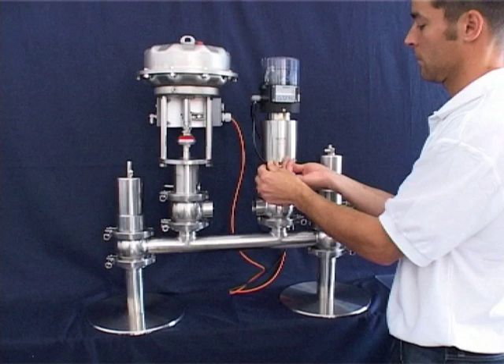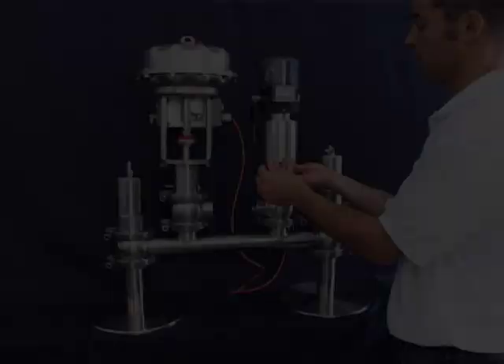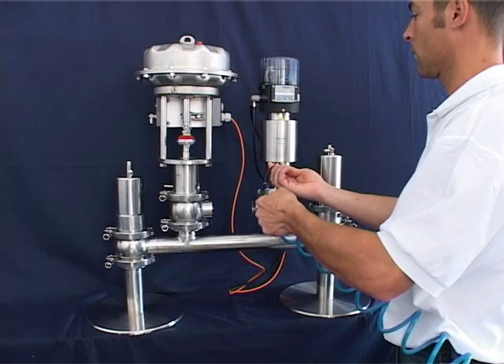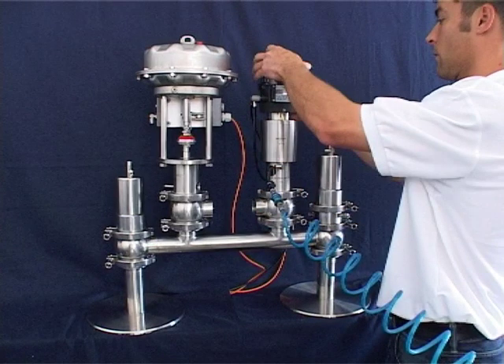Remove the air supply from the valve when the valve is completely closed and all of the control air has escaped. Remove spring tension for normally closed executions with a minimum of 5 bar or 75 psi of control air.